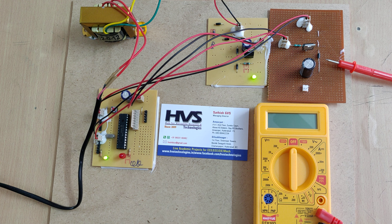Now the demonstration: when we switch on the kit, there will be two power indicator LEDs on the motherboard as well as the regulated power supply board. For testing, place the multimeter in the 20V DC range and place the negative probe on the regulator ground. For checking the input voltage, we can see it reads 4.99 volts — near to 5 volts.